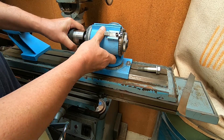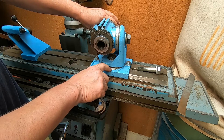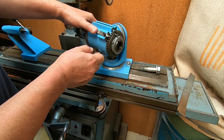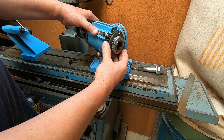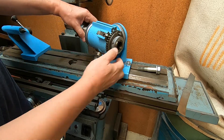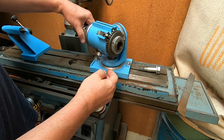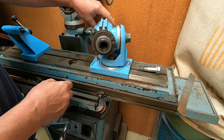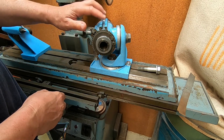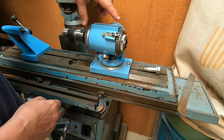The head obviously rotates this way — you loosen it off, rotate that way — and both movements are against a graduated dial, so it's pretty flexible. You can use that to set the steps around, or if you just want to rotate freely, you wind that in and then loosen the lock screw and it's free to rotate. Not sure what the purpose of this groove here is — it's obviously a T-slot so you can clamp things onto it. Maybe I'll discover in time what the intended function is — perhaps it's to hold index pointers or something.